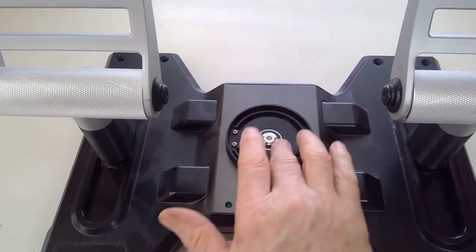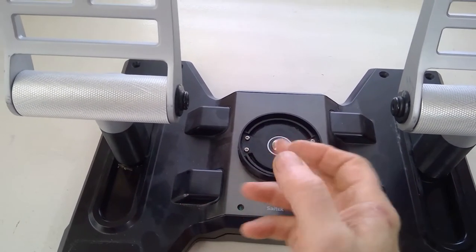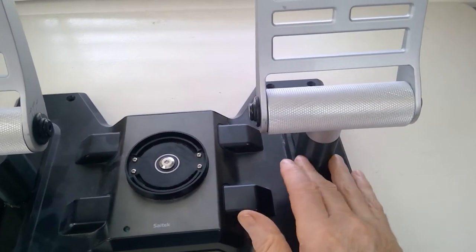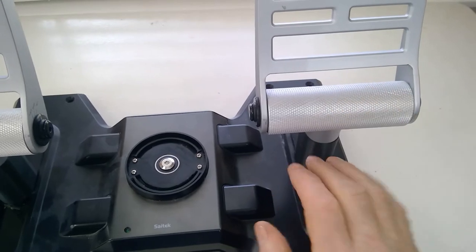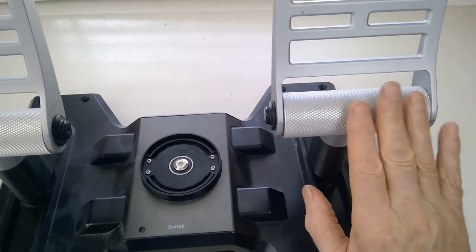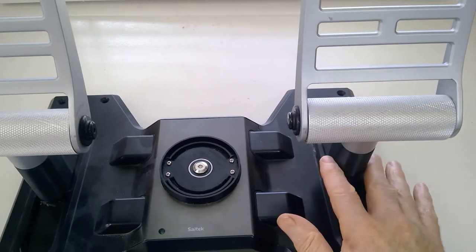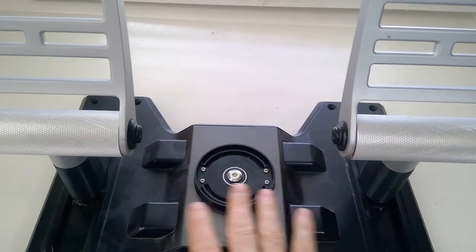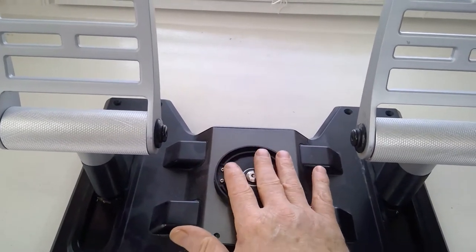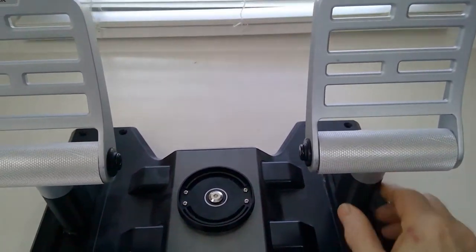Here you can see the top plate that I made with the bearing insert and then a Chicago nut holding it in place. There's a Chicago bolt in the bottom. At the same time I made these stanchions to bring the pedals up a little bit higher - I did 60 millimeters and I really probably should have done them at about 30, because I have 12.5 size feet and these are a little too tall. I'm disassembling it now because a force feedback motor will be installed that I've designed, so I'll probably make shorter stanchions for the foot pedals.